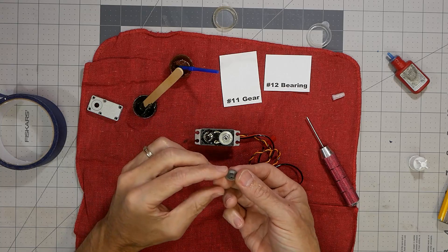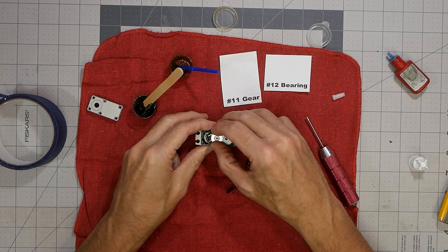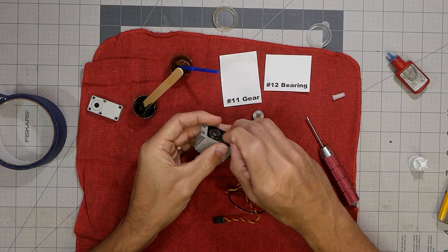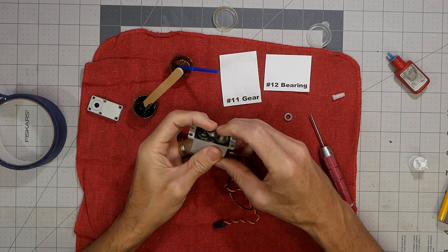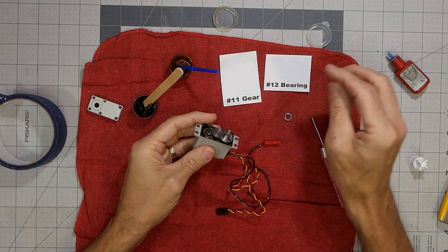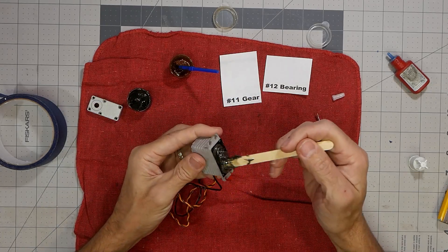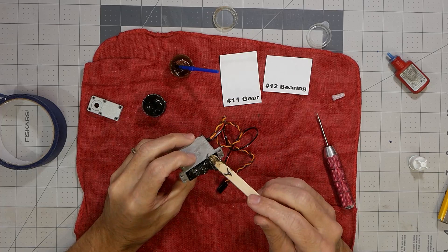The fix is simple — pull the gear off, pull the bearing back off, slide the gear on first, then slide the bearing on top, and everything is fine. Getting all the gears lined up and getting that bearing reinstalled, I then put a little marine grease on the gears and worked it in, making sure it's not too much but a good liberal coat. Take your time making sure the mesh is lining up, give the gears a spin to move the grease from one to the other so all the teeth are well coated.